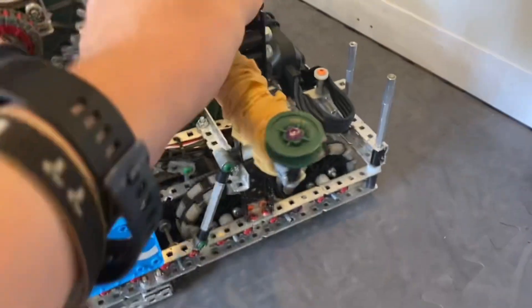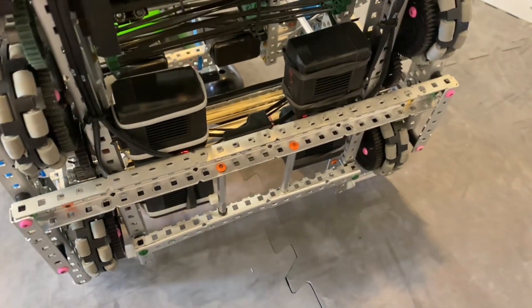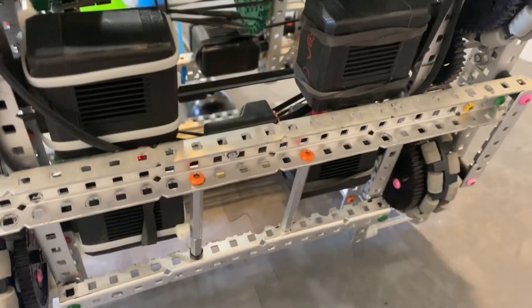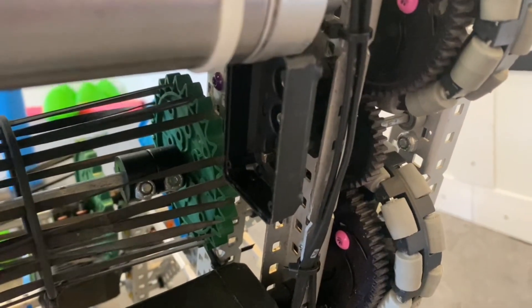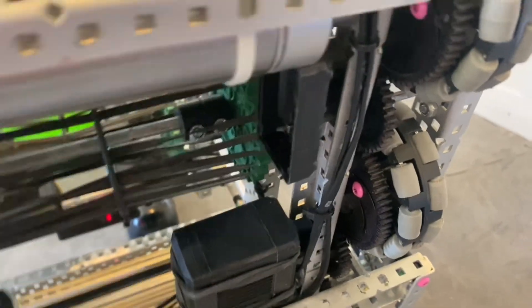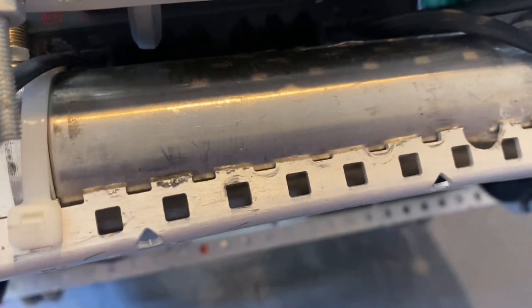With our bot we decided to go with 360 RPM. Originally we were going to do a six motor drive so our flywheel is only 11 watts, but we actually had to bring it down so our flywheel could be 22 watts, so we only had a four motor drive — it burned out pretty fast. We still have the motor caps for the six motors because they're in a really awkward place to take out. We had a lot of things mounted really low, like our tank and our battery are mounted pretty low.